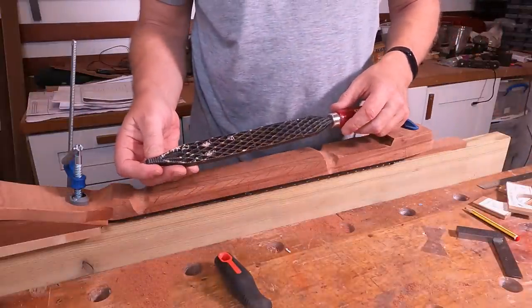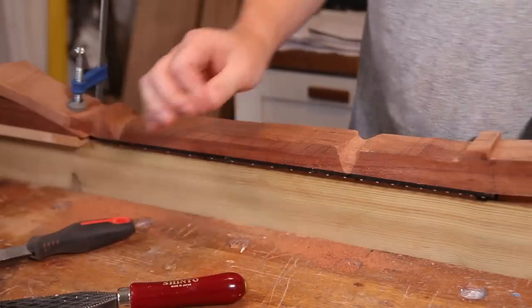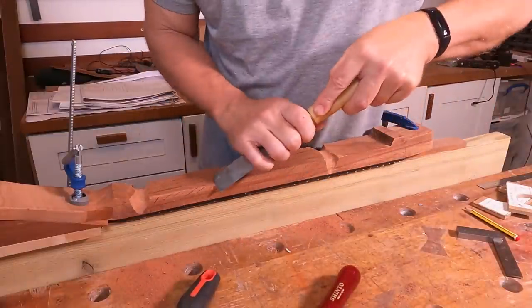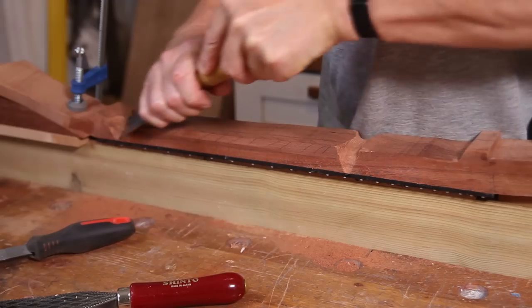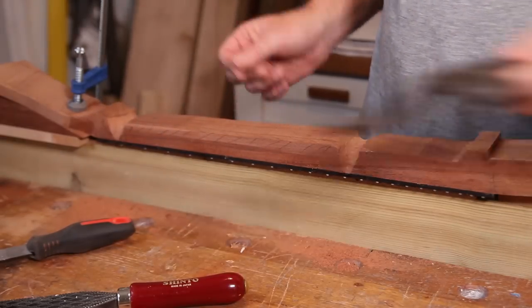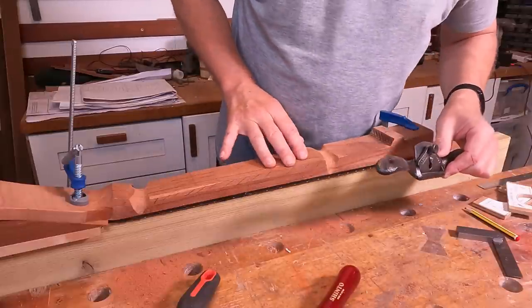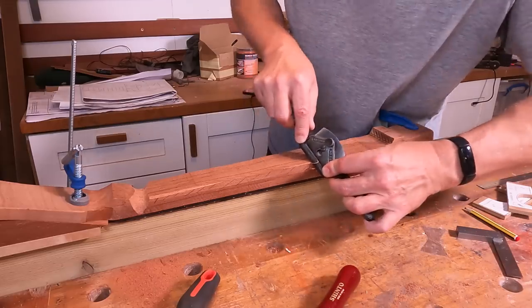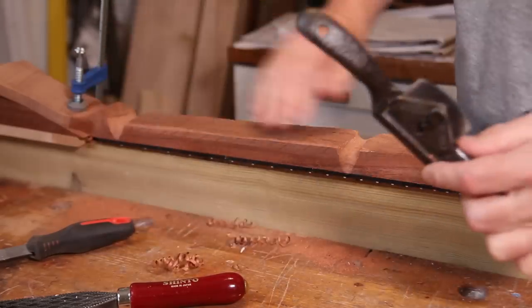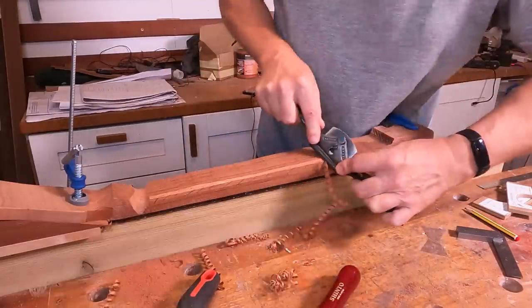To remove that waste - we've all seen me use a shinto to do that. It's a very very good tool for doing that and I probably will use that in a little while. If you are struggling for tools, there's nothing to say you couldn't use a chisel to do this, as long as you were careful with which way the grain's going - but that would take a very very long time. I'm going to try using a spokeshave on this, A because it's one of my favourite tools, and B because I think it will do a really nice job, as long as I pay attention to which way the grain's running. And that's actually cutting really nicely - I really can't see that being a problem.